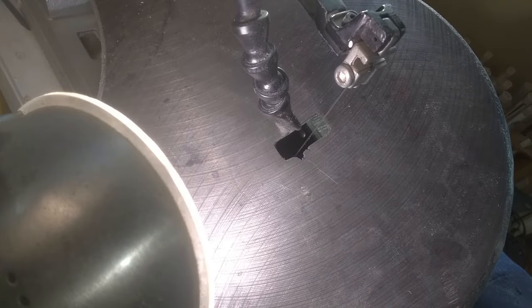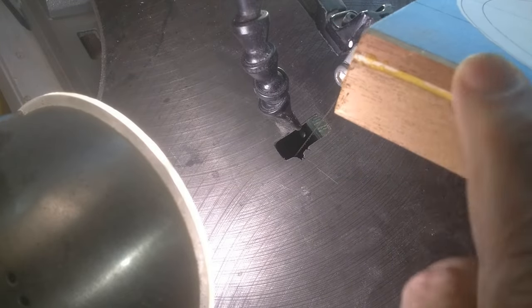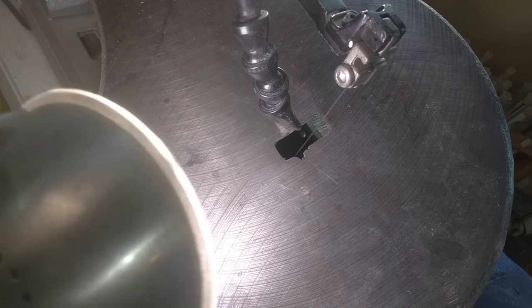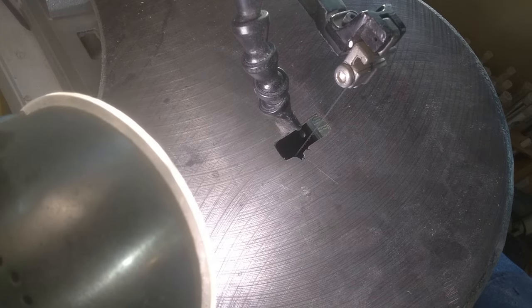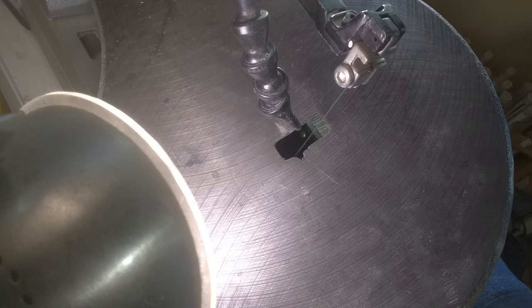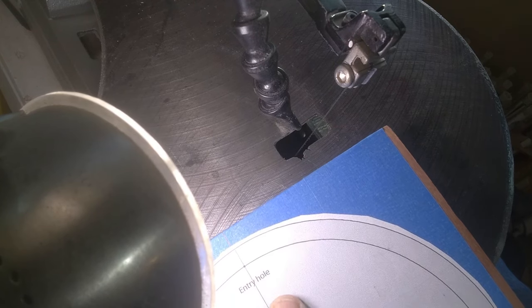While the glue is setting up for my little maple veneer on one side of that accent ring, I'm going to make the first cut - the outside cut on the top blank, which has the maple sandwiched in it. It's mahogany, mahogany, and a sixteenth inch maple for that little ring around the top. I'm going to cut this outside one at 28 degrees. I've double checked that - that's what it's set for. I've got a number seven blade in there. There's only one ring for the top, so we'll have a bunch of three-quarter inch mahogany left over for another project.